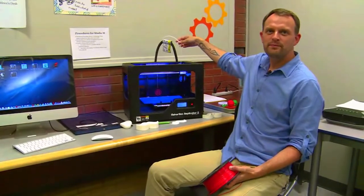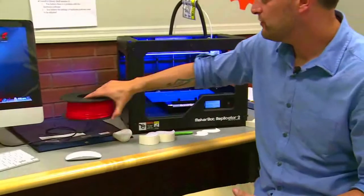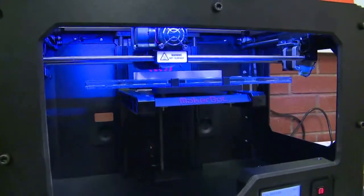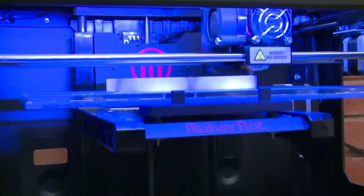Right now we're working with a white filament. It goes through the machine and then there's an extruder down here, which is pretty much like a hot glue gun — it extrudes at 240 degrees centigrade. As it's pushed out, it's melted, and as it hits the platform, there's a fan which cools it instantly. So the second that a print is done, it's actually capable of being picked right up and taken off the plate.